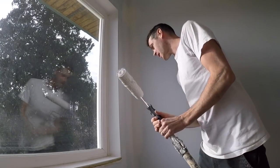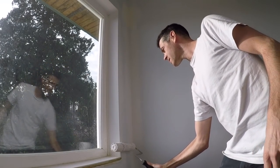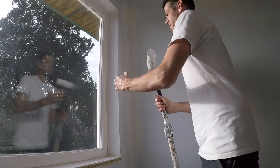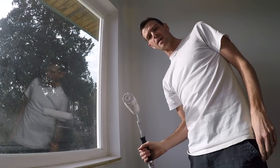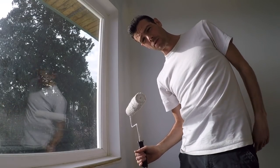Don't forget to check the other side really quick because maybe you just mashed the paint back over. Very gently roll up and down so that you're not pushing the paint onto the other side. But now let's get to an actual corner and show you how these are made and how to stop doing them.